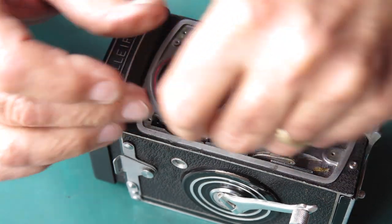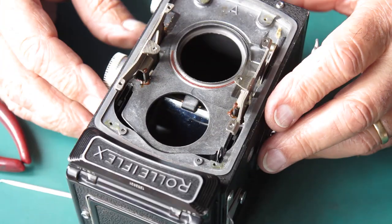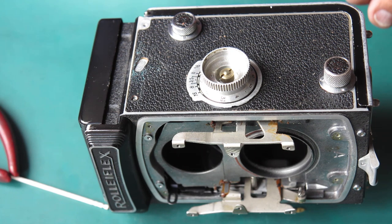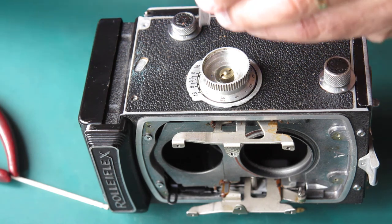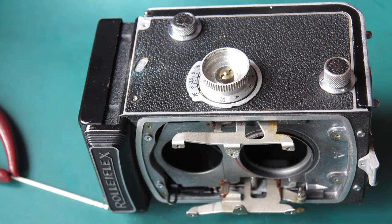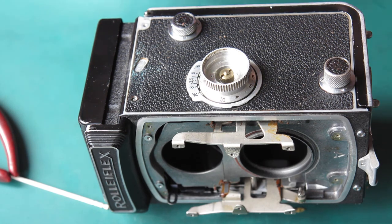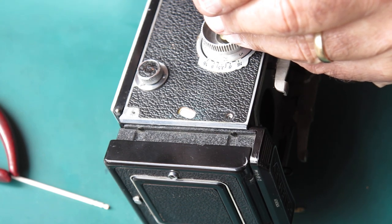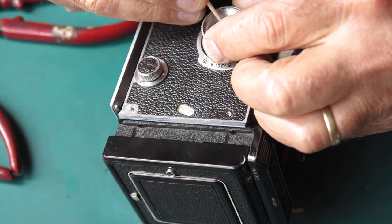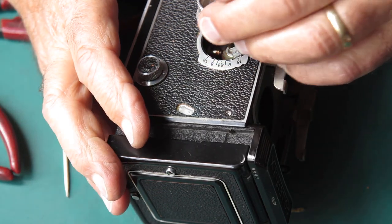What was that? Oh, that just fell out of the front of the camera — it sat in there like that. Those two pieces to one side — that's just a light baffle, more of a dust trap around the lens. I want a screwdriver to suit that nut. I've got a screwdriver that may fit — oh, it's a bit short; the slot isn't deep enough and I don't want to butcher that one, it's a special one I use for Retinas. I'll try pliers — yes, they'll do the job. That nut wasn't particularly tight, in fact it wasn't tight at all. Focus knob comes off.